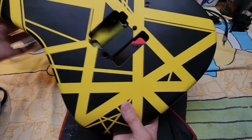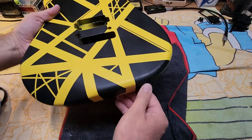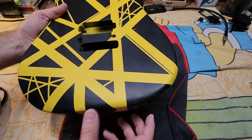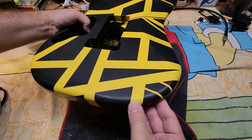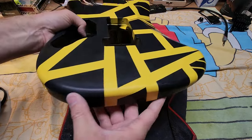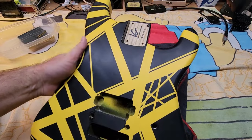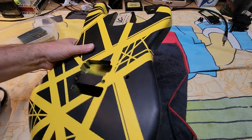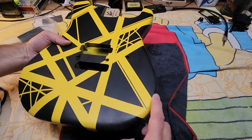All right, there it is, the 2000 grit and the sides. I just noticed a couple of areas around the perimeter here that I'm going to have to go back through. So definitely keep spot checking your work as you dry and move around. Some places will reveal themselves that you might have missed. Other than that, yeah, the 2000 grit goes by relatively quickly. I think I spent all of about 10 minutes on the front, the back, and the sides. Now I'm going to go back and touch these areas up right here on the roundovers.